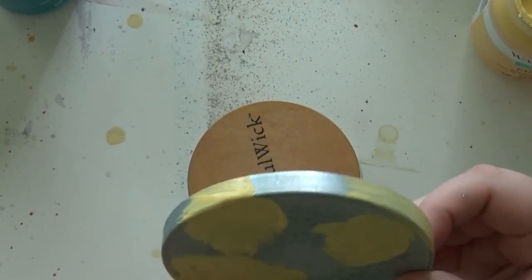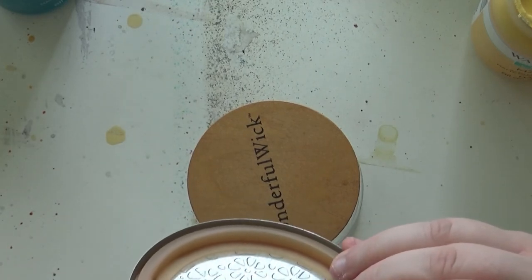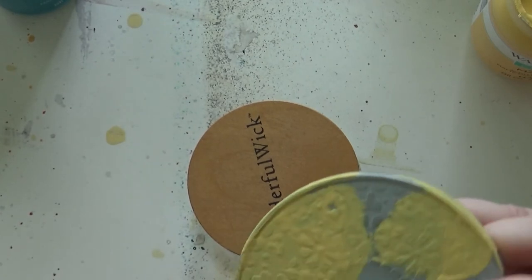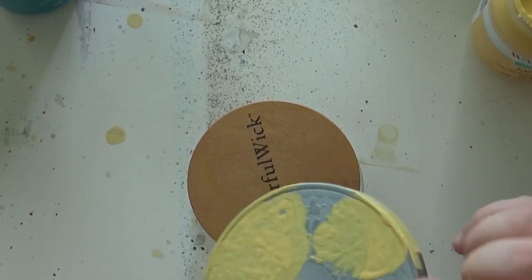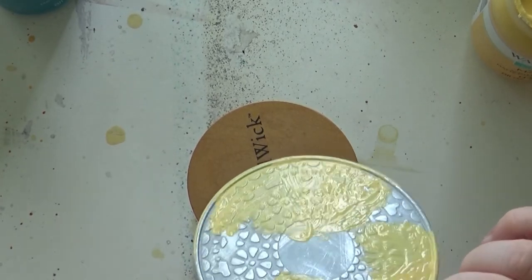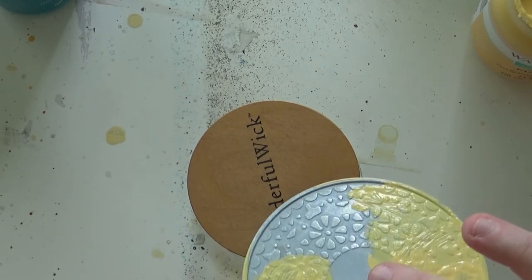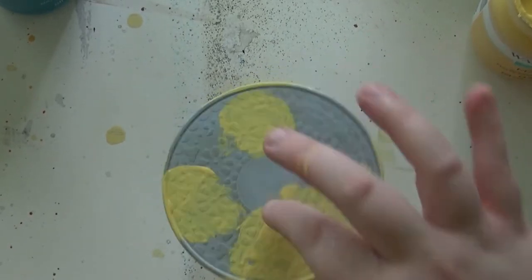This paint likes to cake up a little bit, but that's what it's for. The thing about chalk paint is you don't have to do any priming — the paint's gonna stick. You do have to seal it with something, which I'll show you later, because until you seal it you could just scratch it off with your finger.